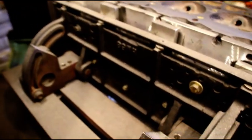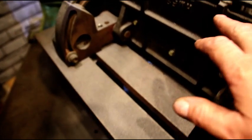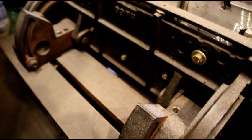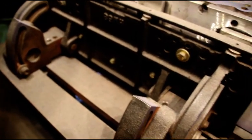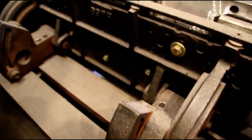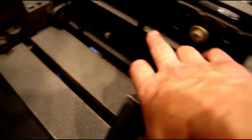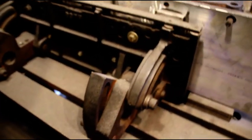This is the main jig that comes with most Block Masters, and this will fit a lot of heads — Chevy, Dodge, Oldsmobile, you know, everything. But it won't take a 258 head. So I have this aluminum jig here, and this gets bolted to the head and then bolted to the jig here — there's one, two, and then one, two, three down here — and that holds everything nice and rigid.